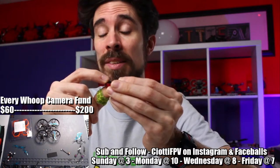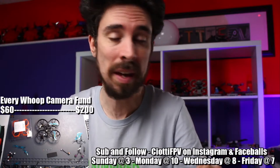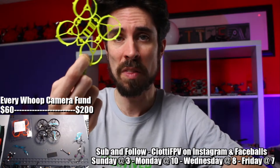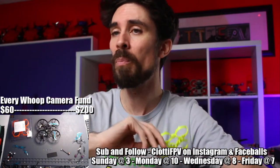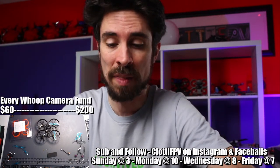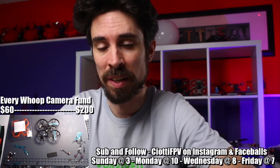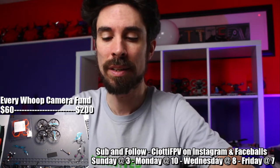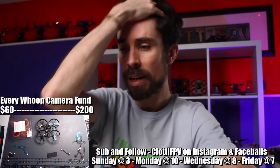And yeah, it also has that. I was trying out that carbon fiber brace on the bottom, which does the exact same thing, right? An all plastic whoop frame is one thing, and then any kind of carbon fiber bracing completely changes the game, and it really does stiffen it up. That's the point of it. But what's wild is with Tiny Whoops, we don't need that stiffness. That additional stiffening doesn't accomplish anything meaningful, and the problems that it causes are way worse.